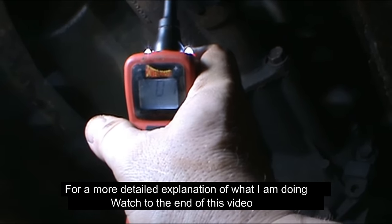The way to check to see if you've got a good ground — from this junction here on the wire — is to change your multimeter over to ohms. Leave the negative side of your multimeter hooked up to ground, which in our case is the frame. Take your positive and touch it, and you get nothing — nothing changes as you touch it. That blip was just what I call ghost voltage, but there's nothing really there. So from our frame ground to there, we have no ground.